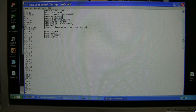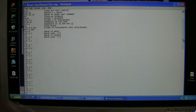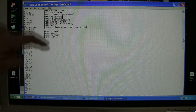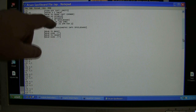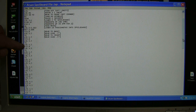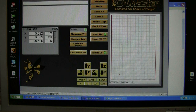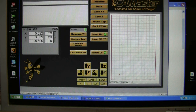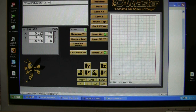The code is Y 35.8, so it's going to travel from the front of the table to the back of the table. Then I have an L91 X point 5, so it's going to move across 0.5 inches, then it will go back down to Y zero. Basically you're going to go up and down. I load the file into WinCNC and hit the preview button.